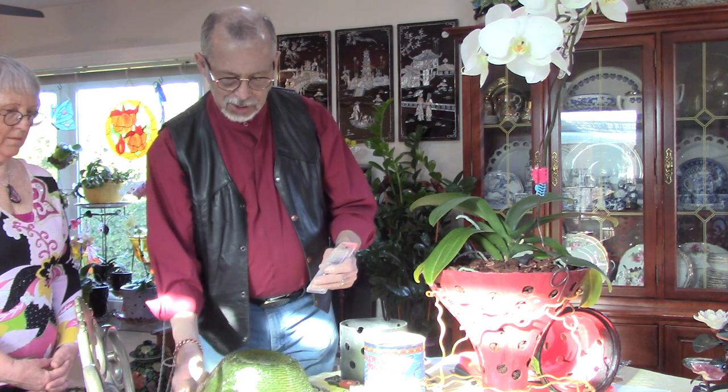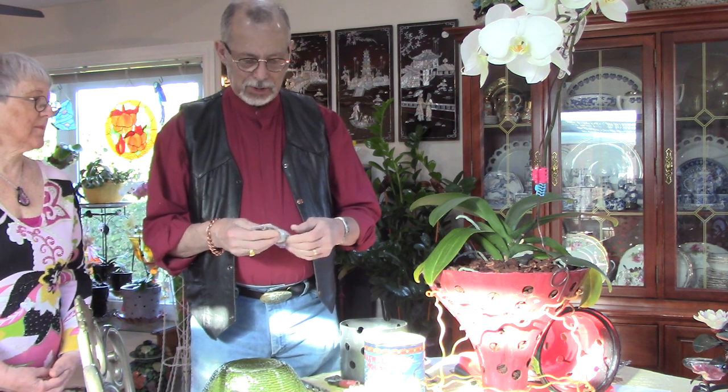Now, they'll tell you that you don't need the water. I could take this bit and I could drill a hole in here with no water. But you know what? They don't try to make these things to last forever. They make them economically. There's a cement that holds those diamond chips on there. Well, that cement, like most cements, heat will break it down. And there's a lot of heat that comes from this if I'm not using water. I would be lucky to get half a dozen holes out of this thing if I didn't use water. But by using water, this thing is probably just as good as it was new, and I can make holes again and again and again. I've drilled lots of holes, and I still use this bit, and it's great because I always keep it wet. I don't run dry.